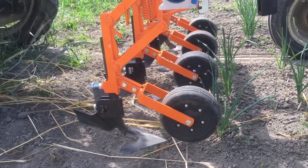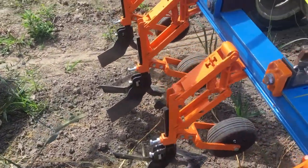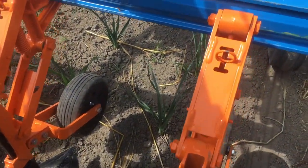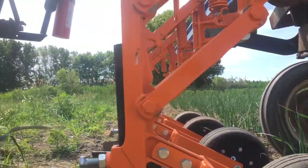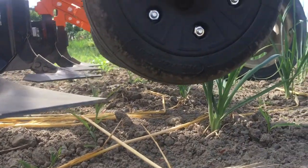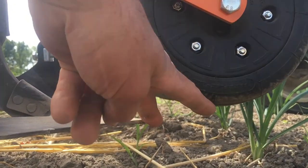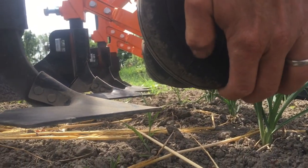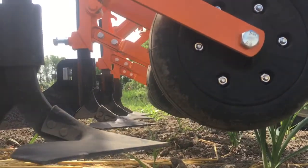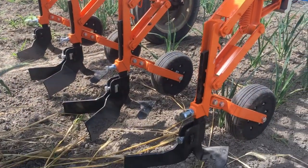So here we're aiming for something much more slim. Each row unit will still follow the ground with tracking — you can see the difference. We've got about maybe three centimeters, and you also get compression both of the soil and of this semi-pneumatic tire on the depth gauge, the depth wheel.